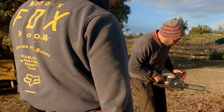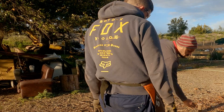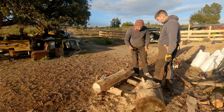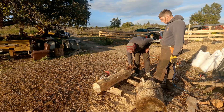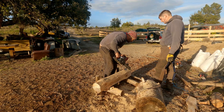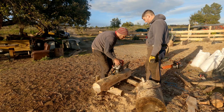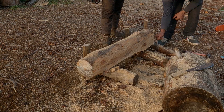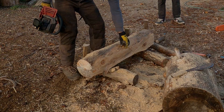So now maximum one, two, three teeth. Take off the guide and try to do this line as parallel as you can with that one. Because it's super sharp, it really went deep on the first marking. Try and go slightly faster if you can. Bring it down without touching the end just so you can see that line — it really helps. When you're like this you can really see if it's parallel. When you start cutting, have a look to make sure it's coming down straight and parallel — it's very pleasing to see.